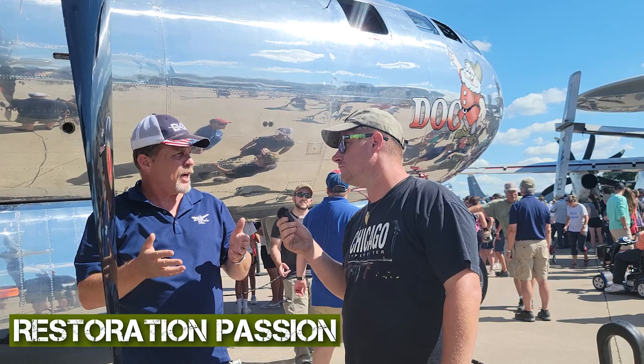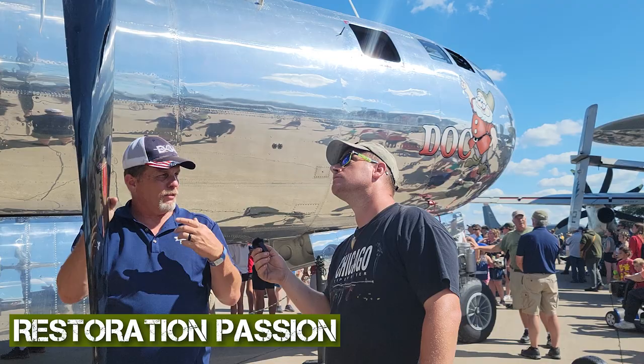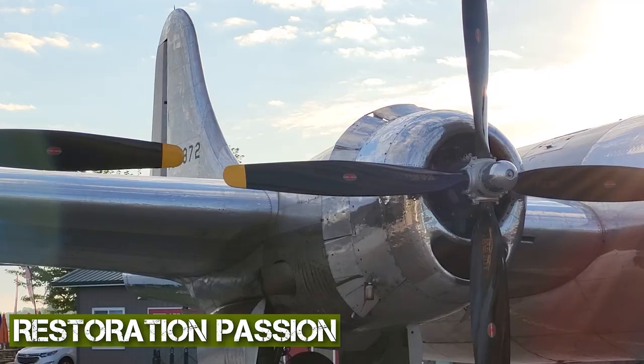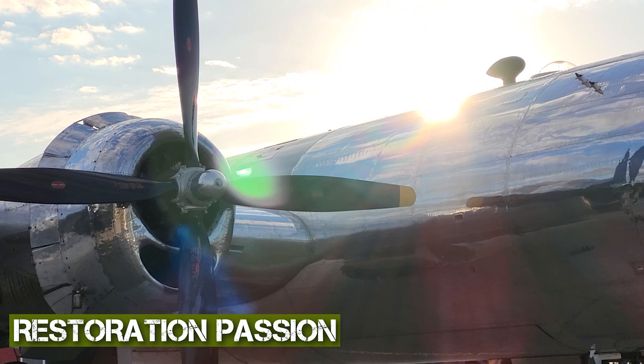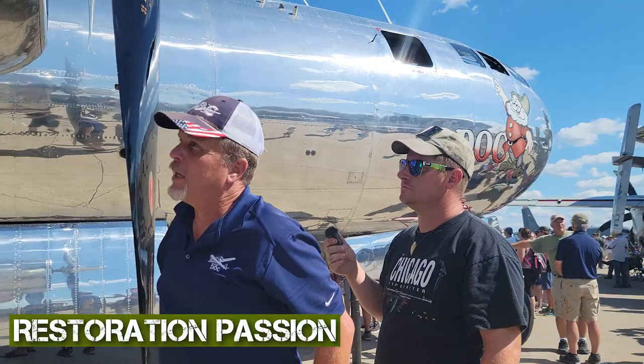and combined those together almost like mismatching small block Chevy parts, we ended up with an engine that actually could fit inside this nacelle and that we could run this massive propeller on. Right, instead of having to go to shorter props or change the nacelle, we got it to fit in there. So, like I say, on those engines now, the exhaust on both rows of cylinders exits out the back. So there's a header that was fabricated, so you don't see the ring up there anymore, right? So yeah, it all exits through the back.